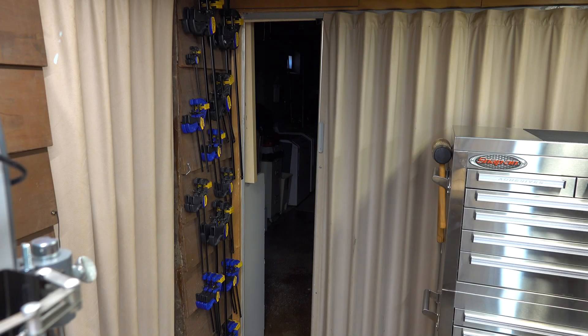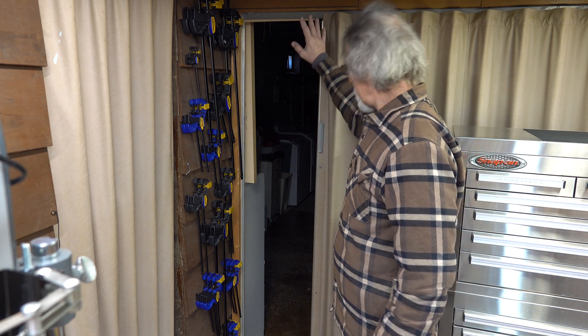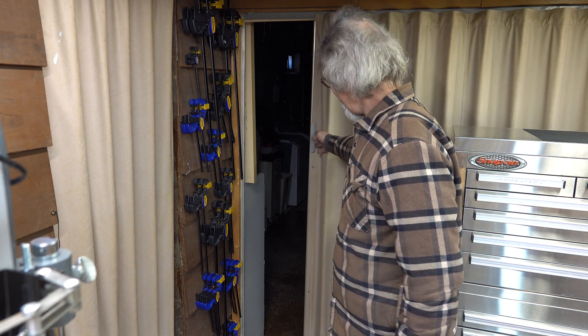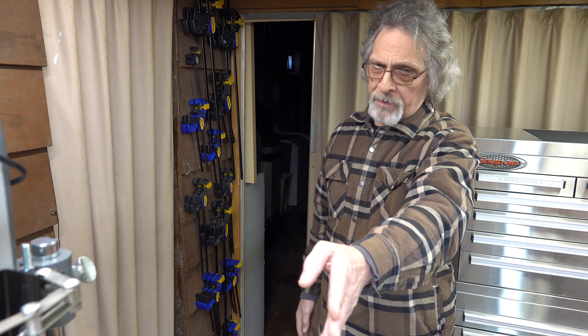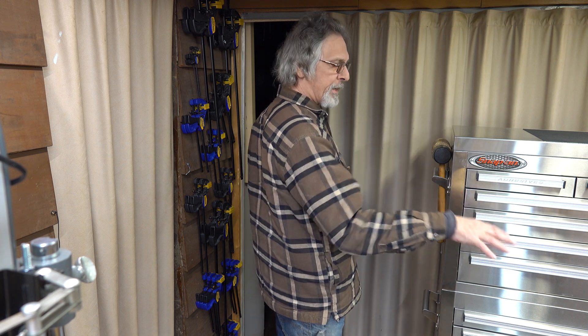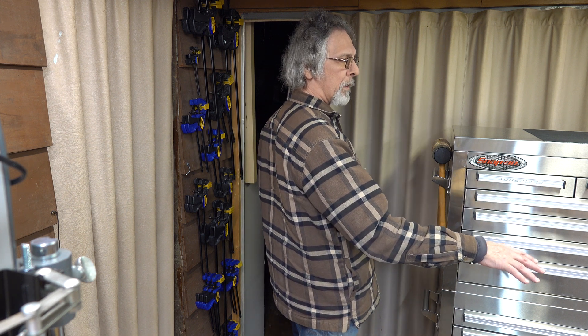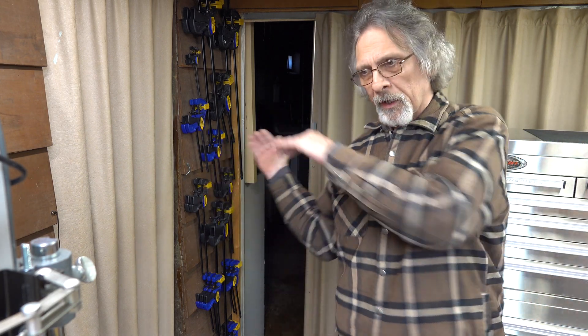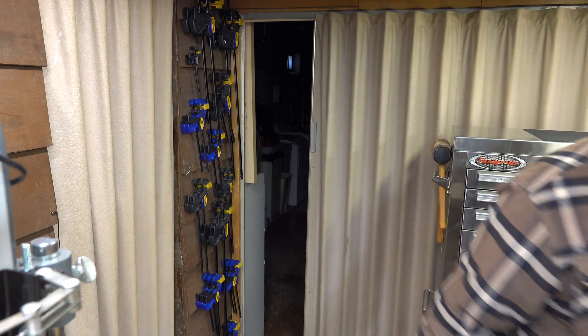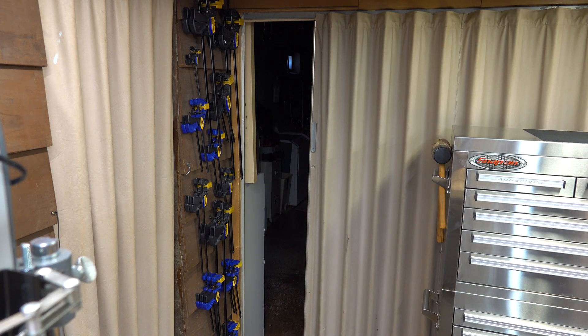So high pressure air is coming through this area. And I purposefully have it necked down to increase the airspeed, so it follows around the corner and gets to the edge of my bench and starts to then curve inward. If I find that I'm doing a lot of routing, this area right here will be a dead zone and it won't get cleaned properly at all — there will be a little cloud floating around right here. So all I have to do is open this up all the way, and now all of the air moves this way instead of coming around through the bandsaw and around. So it's all about making it work like a water stream — it's literally a lazy river of air.